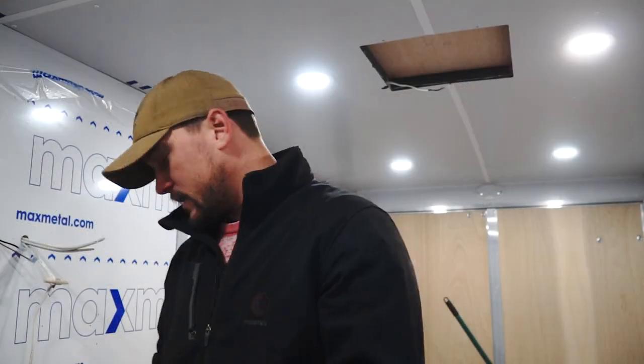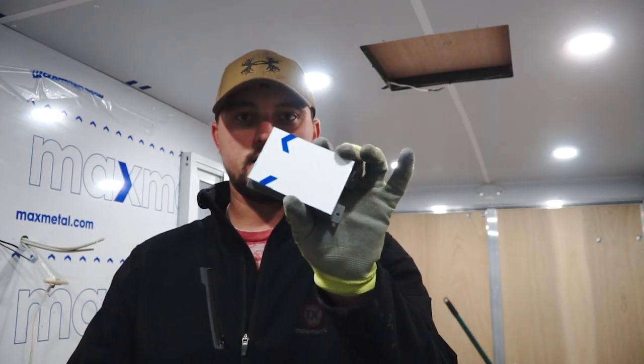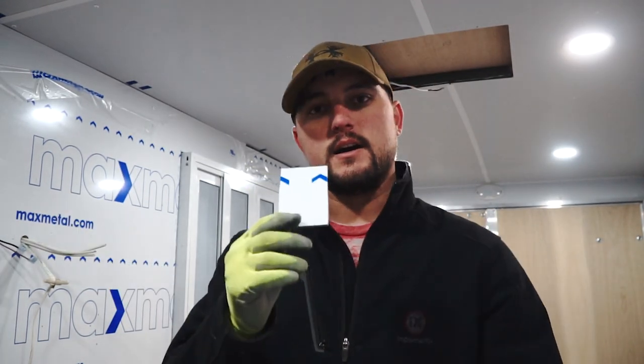I'm back inside and I'm going to start cutting out my electrical boxes. What I did was take my shallow box that I'm using for all my outlets and light switches, trace it on the back of a piece of scrap ACM panel to make a template. Now I'll use this template to go around to each spot where there's an outlet or a switch, trace it on there nice and square, then come in with my oscillating multi-tool and cut them all out. Then I'll start dropping the boxes in.